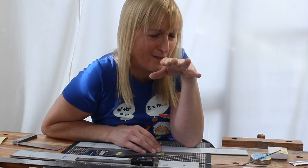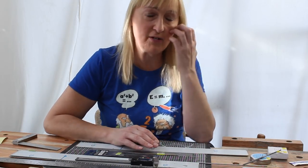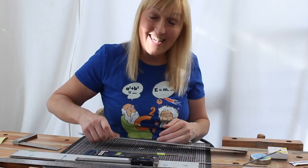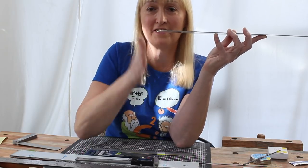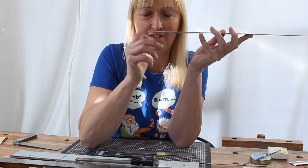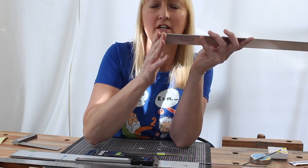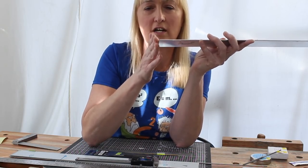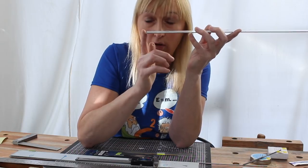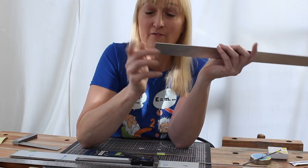I hope this is obvious. But the point I'm making here is that the minimum amount of compensation you need to introduce is generally about 0.5 millimetre. And that is the same as cutting down the slot of the zero fret. You're reducing the length of the fretboard by maybe as much as 0.5 millimetre, particularly if you then sand the sawn end of the fretboard flush, so you get it nicely prepared. You will have shortened the fretboard by a small but significant amount and introduced nut compensation. So in fact, that's a good thing.